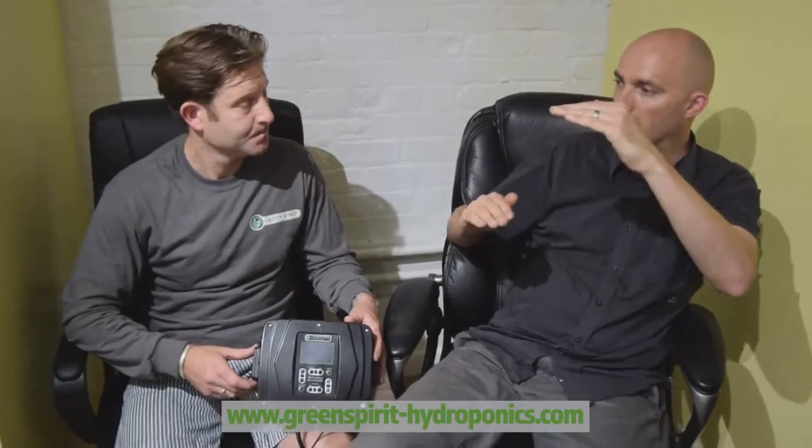Unless they're different sized fans. So if you want your intake and outtake different, you just have a larger fan. It's basically standard — what we've been doing since day dot: if we ever sell a fan and filter to someone, we make sure that the outtake is larger than the intake, and then you're always going to have negative pressure. So if you've got a 10 inch fan and filter going out, then you want an 8 inch inline fan coming in, for example. This will ramp up both those fans at the same rate — they'll ramp them both up and down at the same percentage. So you hold the same negative pressure.